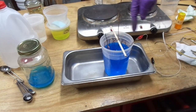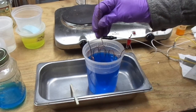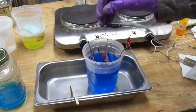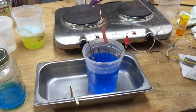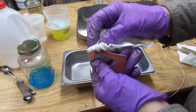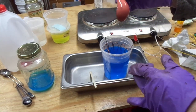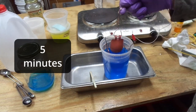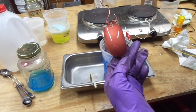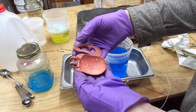For this part — the lever cap — I have a ring of copper wire going around, hooked up to the positive. Now we'll hook up the ground. This is at 3 volts. It's been a few minutes; I've taken it out and put it back in, and I'm stirring it by hand. That looks like a pretty even coppery coat. And there we have it — that's a pretty even copper coating. Here are the two pieces dried after the copper plating. Definitely have copper on them.